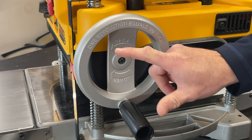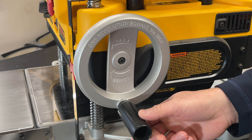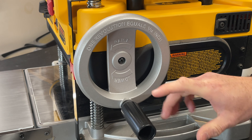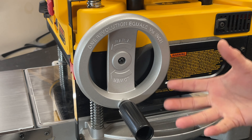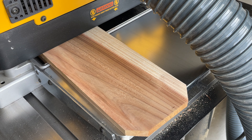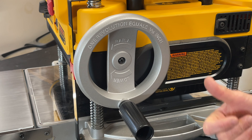The height knob on the side says 1 revolution equals 1/16th of an inch. So to raise it up or lower it down 1/16th of an inch. A lot of what I do is just finishing — I'll do 1/16th of an inch at a time because I'm not really worried about the final thickness, like when I ran six dozen cedar pickets through this thing. All I really wanted to do was make them look better and take off the chatter. So 1/16th at a time — perfect.